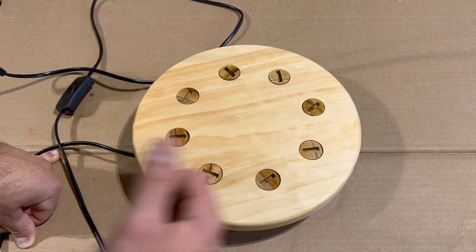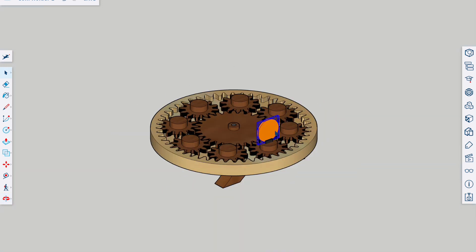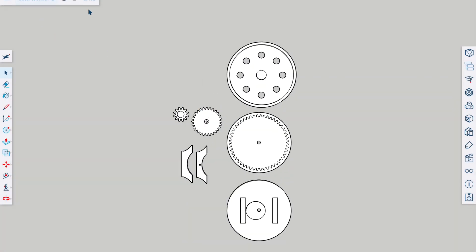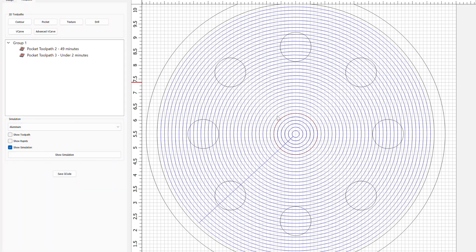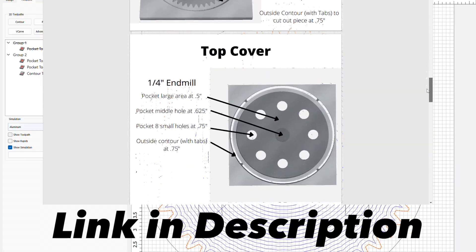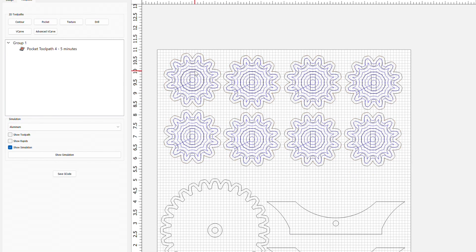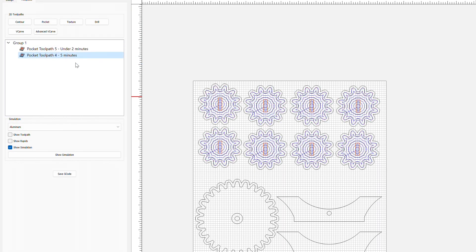Now that my design is finalized, let's actually go build one using nice wood. Like most of my CNC projects, I started off designing this in SketchUp so I could make sure all the components fit together and play around with tolerances. Once designed, I laid out my components flat and transferred them into Carbide Create, the program I use to program the toolpaths for my CNC machine. For the sake of keeping this video short I won't go into too much detail on assigning toolpaths, but I do have a detailed guide and the SVG files in the description. Overall this project uses two different CNC bits — a quarter-inch bit and an eighth-inch bit — to do pocket carves and contour carves on three different pieces of wood. One piece is carved on both sides, so overall it's four carves in total.